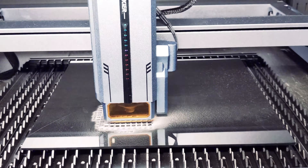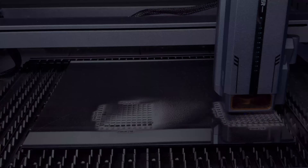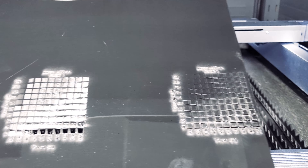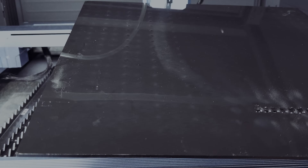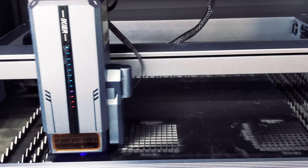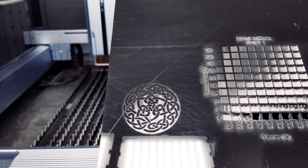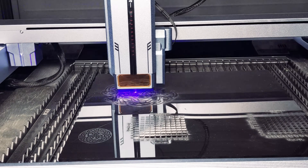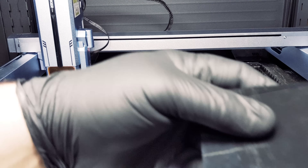Next, we tried an acrylic engraving test and an engraving cutout test. We got some very good results for our engraving test on acrylic — we were successful especially at higher power and higher speed settings. For cutting, we would probably need another pass or perhaps lower speed. We ran our engraving design on acrylic and were pleasantly surprised by the speed of this laser. The engraving turned out perfectly. For the Celtic knot cutout, we need another pass or a little more power to get through the material.